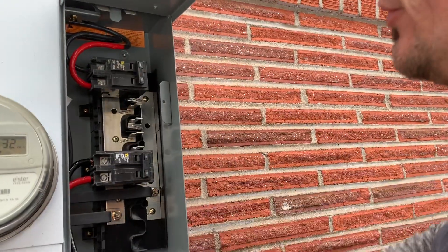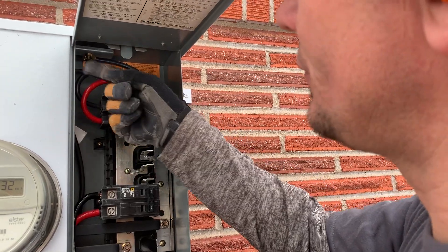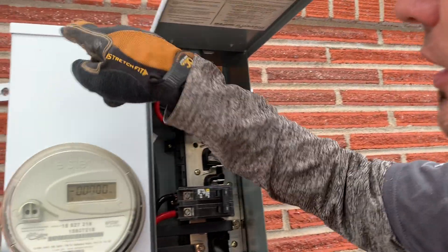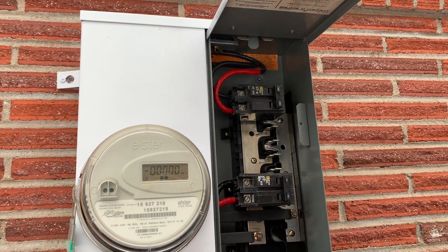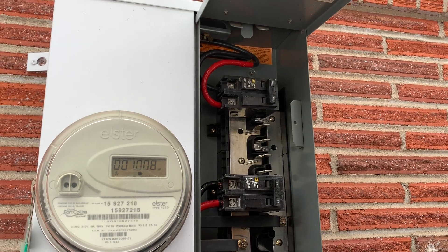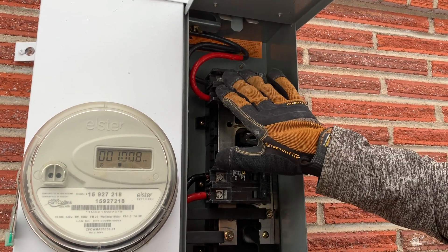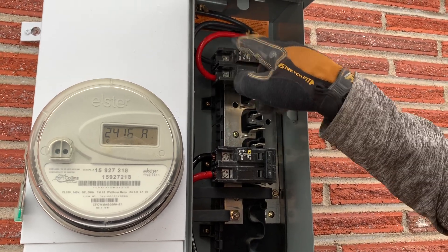So I decided to come off of here. When I opened it, it was really all over the place — these feeders. This is no longer allowed to feed your feeders into this area and go in through here to the house. So if they upgrade, we're going to have to have a direct bore down there and then redo this. Anyway, this is going to be a 100 amp main breaker, 125 amp main panel — can't upsize that, of course.